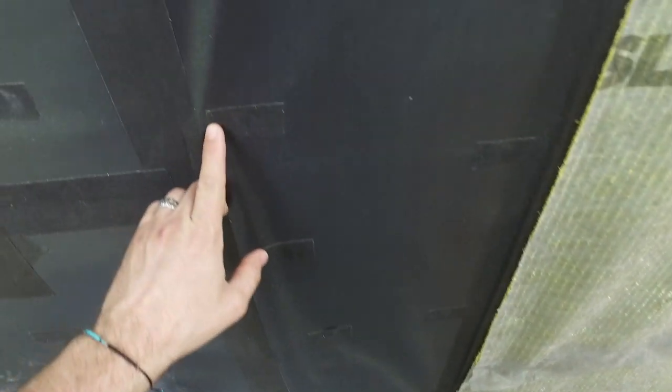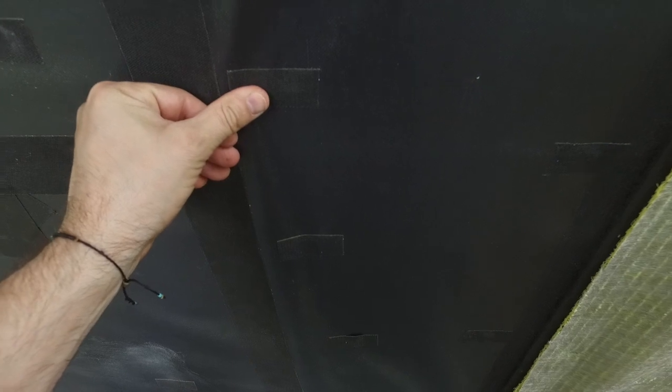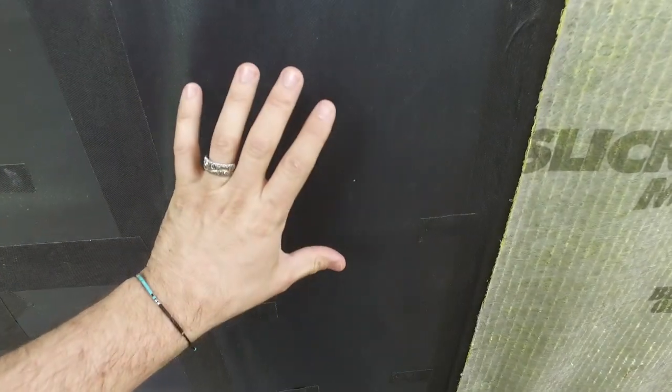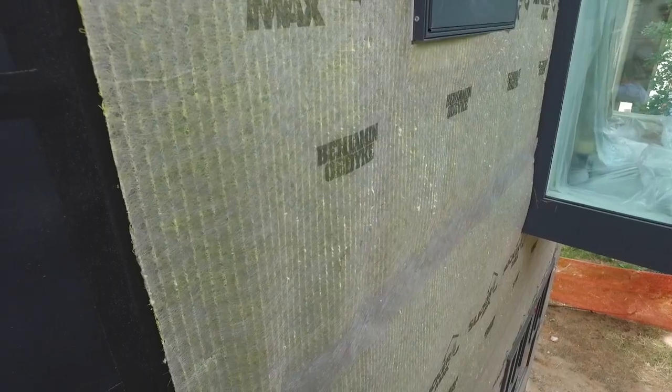We also have this very unusual flashing tape, which some people might be familiar with, but I think a lot of people aren't. It's a fabric-y looking material, and it's slightly vapor open. This product is also vapor open. It's important in a cold climate, so we want to make sure that we're using the right product behind an open joint cladding system, which is not going to be your typical WRB. Before the InvisiRap UV or Slicker Max can go on, though, the primary WRB needs to be completely sealed off.